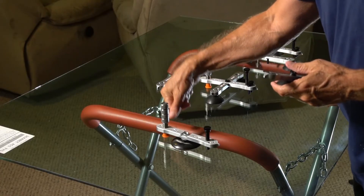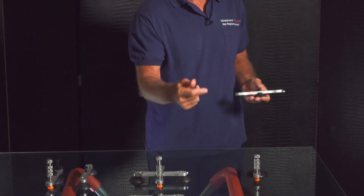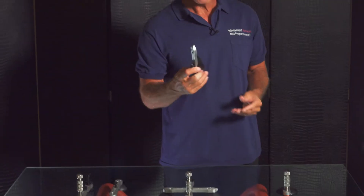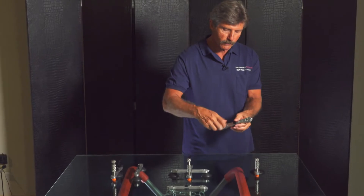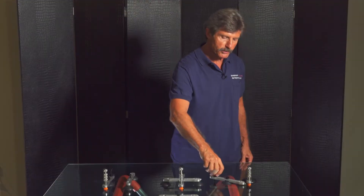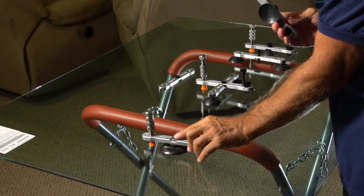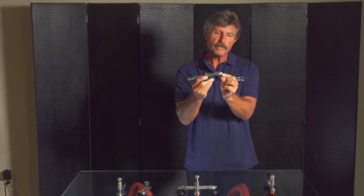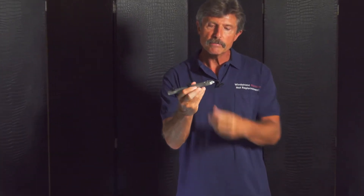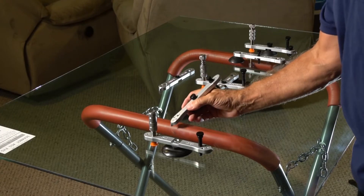This happens often, and the normal way to do it would be to take a metal probe or a screwdriver, press on it and hold it until your thumb hurt, let go, and it wouldn't be totally filled, so you'd have to do it again. With the star leg flexor, you just place it on the leg, push the cup down, turn the bolt until the leg flexes, and wait for it to fill — no more manual pressure. You'll also notice the point of the star leg flexor is pointed, which replaces a tool called the probe that you would normally use to probe the impact point of a stone break. So now you don't need a separate probe — it's right on your tool.